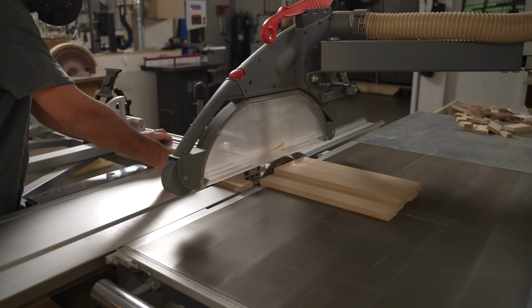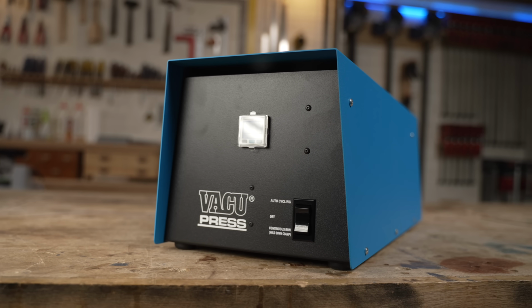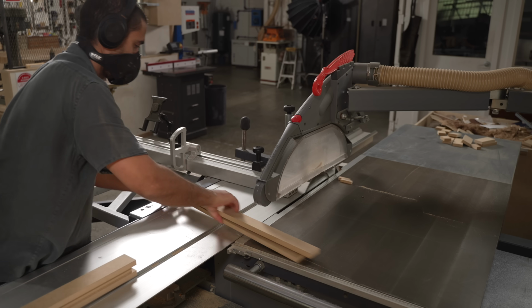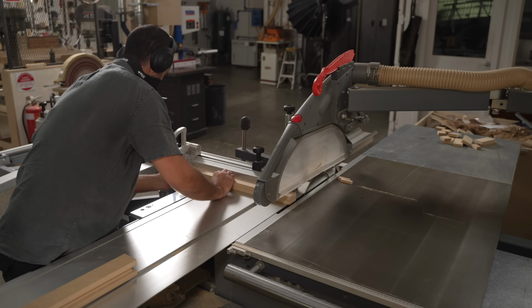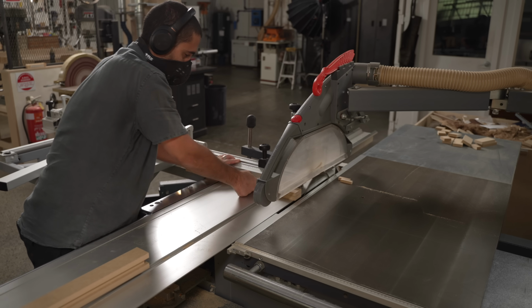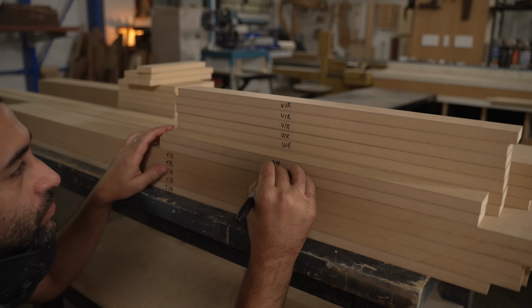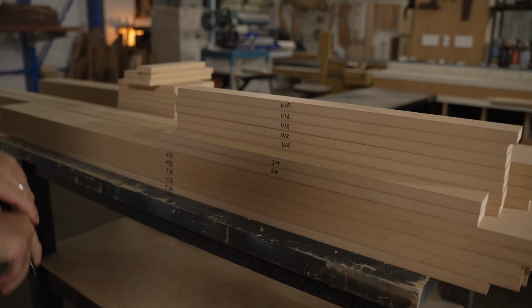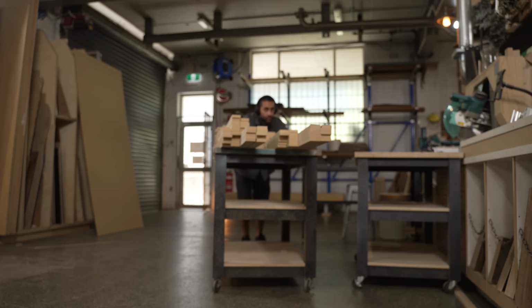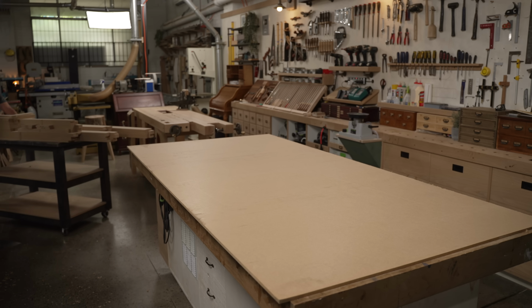Now, that big blue box is my pump by Vacuum Press, who were kind enough to provide me this unit for a discounted price. One of its key features is the auto cycling mode, meaning that once the pressure gets to the correct vacuum level, the pump will turn off, and once the level drops below a certain point, it will turn back on. This is very important if you want to be pressing things for a long period of time, as you can run the risk of your motor burning out before your glue sets. You won't see it in action in this video, but my next video is really going to push the limits of this technique, but more on that later.